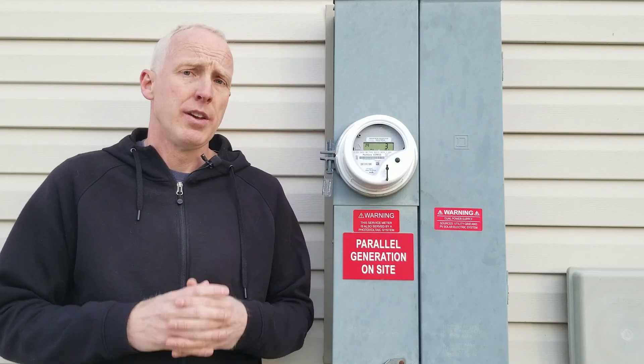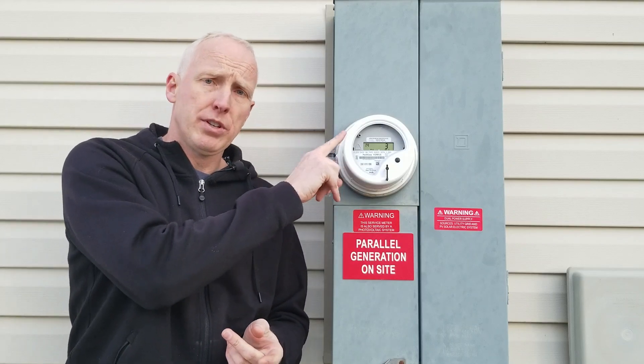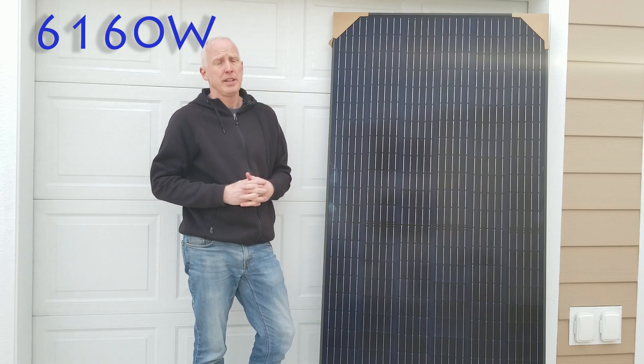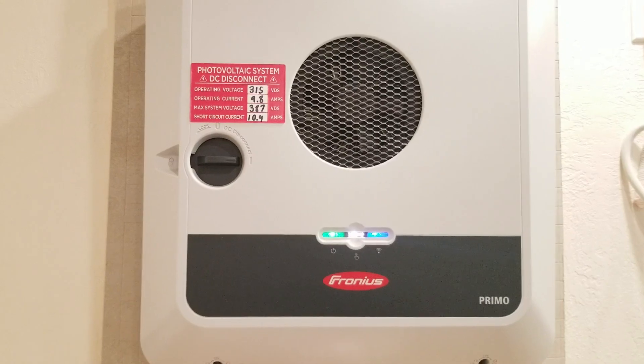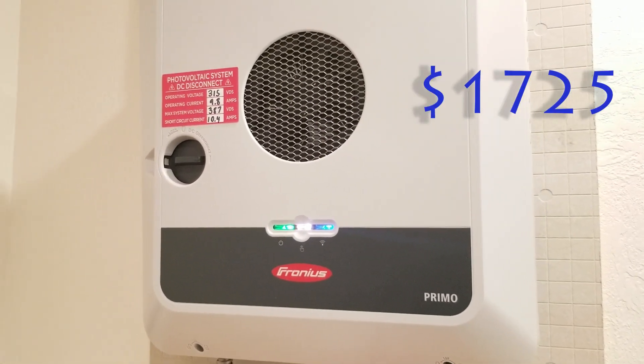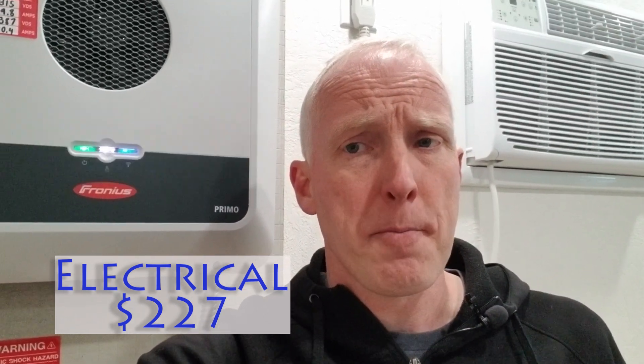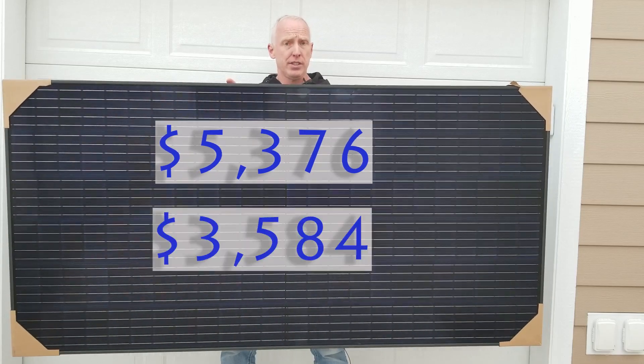In this video I'm going to show you how I installed this grid-tied solar system to my accessory building for around one dollar per watt. I use string inverters, but in a future video I plan on installing more panels using micro inverters. For permits, including the city and the power company to install the net meter, that was $410. For 16 385-watt panels including shipping, $1,921. The Fronius Primo Gen 24 5-kilowatt inverter was $1,725 including shipping. Rails and mounting hardware including shipping was about $1,093, and miscellaneous electrical including cables and conduit was $227 — putting the entire system at $5,376, or after tax credits, around $3,600.